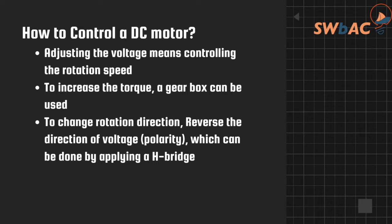The final thing to control is the direction of rotation — either clockwise or anti-clockwise. This can be done by reversing the polarity. Polarity means applying the negative side to the positive terminal and the positive to the negative, so you just reverse the wires. That will make the DC motor rotate either clockwise or anti-clockwise. It is pretty simple to control.